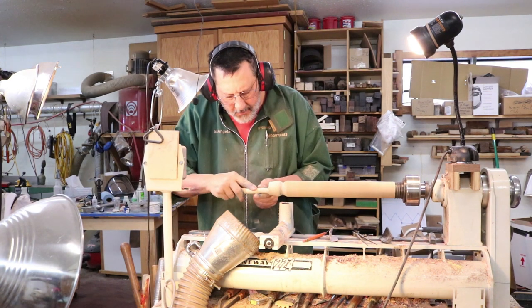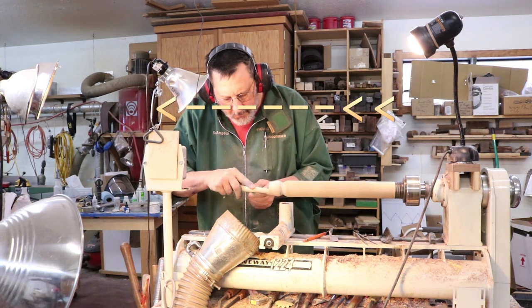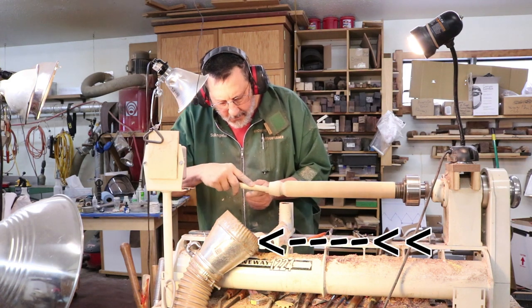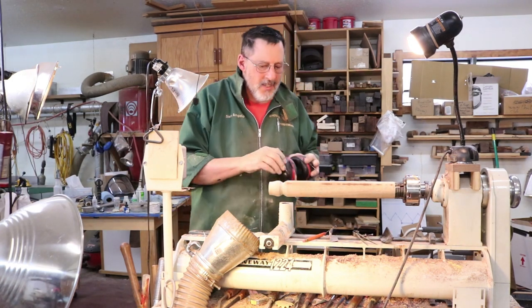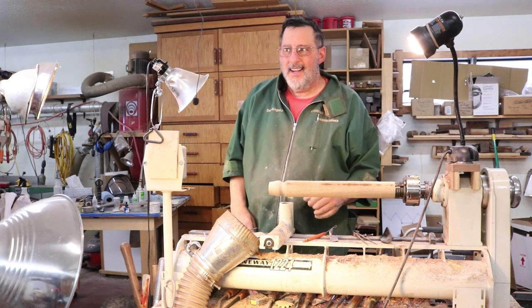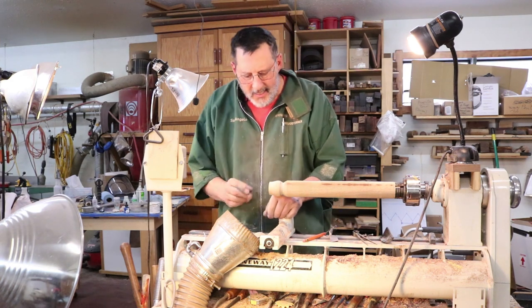About a quarter of an inch down I've got that to the thickness I want, so all I have to do is follow my outside contour and keep hollowing. Throughout the process of hollowing out the bowl on my long stem goblet I experience quite a bit of vibration, but I don't throw this off-center once. I'm using a sanding stick and will sand through 600 grit, put a little bit of finish on this, and then move on to the next section.